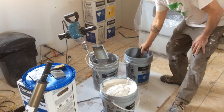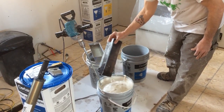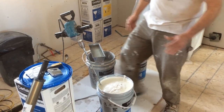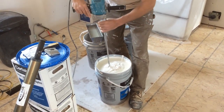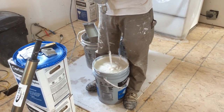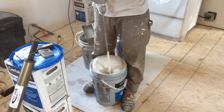We'll put that third pan in, and you know what, you're probably going to use more yet. It all depends on the temperature inside the place you're working at. Right now it's on the cool side in here, so the mud's kind of cool, which makes it spread a little nicer and stay softer. The warmer it gets, the thicker the mud gets, and the quicker it sets up.